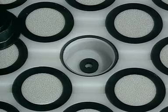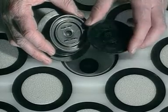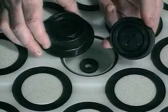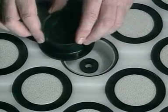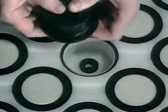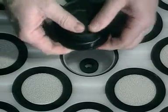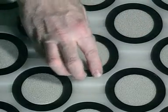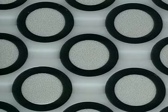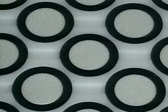Next, the pods themselves are prepared by firmly pressing an extension cup into the groove in the narrow end of the pod, so that the rubber ring on the back of the extension cup fully seats into the groove and the curved lip of the cup points out away from the pod. Once all the pods are ready, place them cup-side down into the cavities of the panel. After all cavities are filled, apply vacuum to the system and check for and correct any leaks.